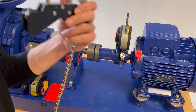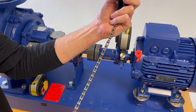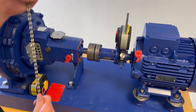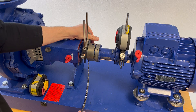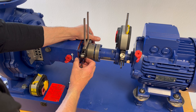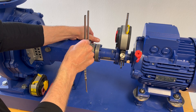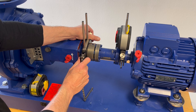Let me show you how to fix the standard shaft bracket plus a 300 millimeter chain around the shaft of the pump which we have left in front of us. I put the bracket on top of the shaft, then put the chain through this gap here and hook one of the chain links on this hook.